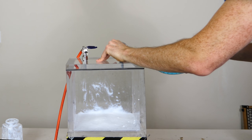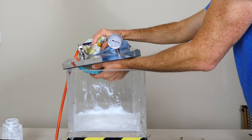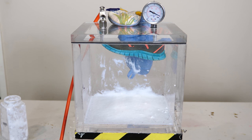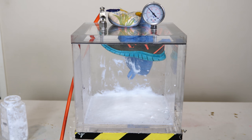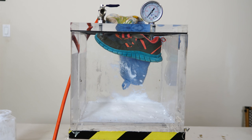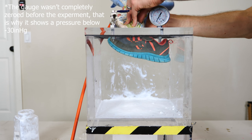Okay, now we can't forget the shoe. We're going to go ahead and suck out the air. Now we're at a full vacuum on my gauge here, and I'm going to let it vacuum out for around 10 to 20 minutes to get all the air out that we can. I've let this sit at full vacuum now — let's drop the shoe.